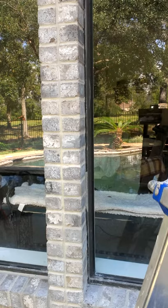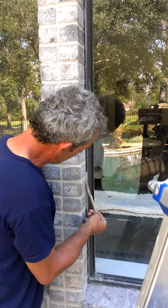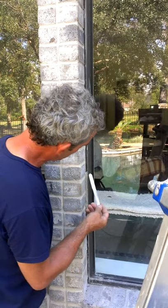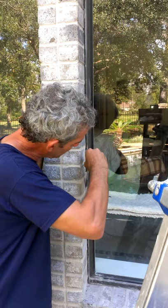What we do is we take our tool — we've got a couple different kinds of tools, everybody uses a little something different. These are actual caulking tools. We lay it on and pull that bead down so it adheres at both the brick surface and on the face of the window. We run it down one way like that, and with brick you have to get it down into the actual joint — there's a little bit of a trick to that. Then we line it back up the other way.